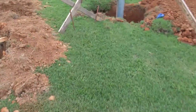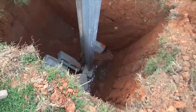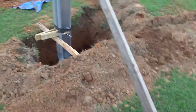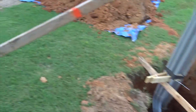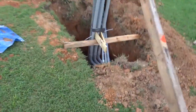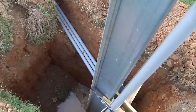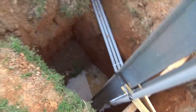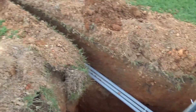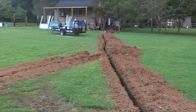Concrete is coming in the morning — everything plumb, straight, square, level, and ready for lots of concrete. It'll take about four yards. If you dig these holes with an auger to spec they only take three-quarters of a yard, but it's very hard to find an auger extension when you're five hours from home and rental companies don't have them. So we just dig. We've got to get this back-filled tomorrow.